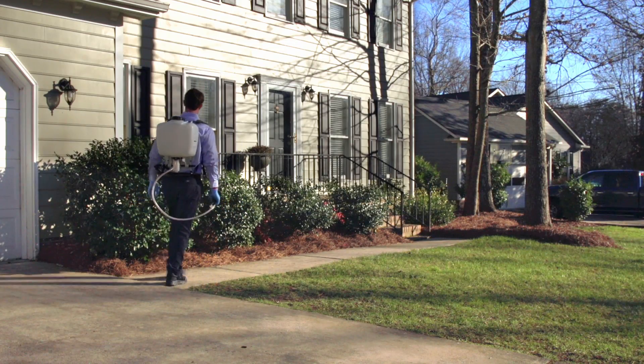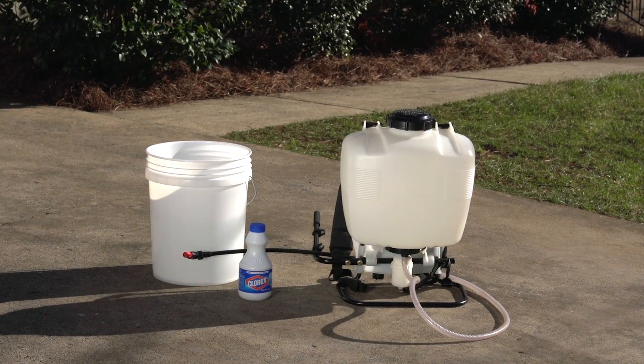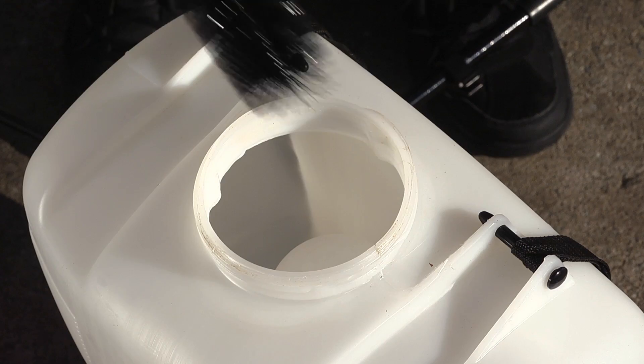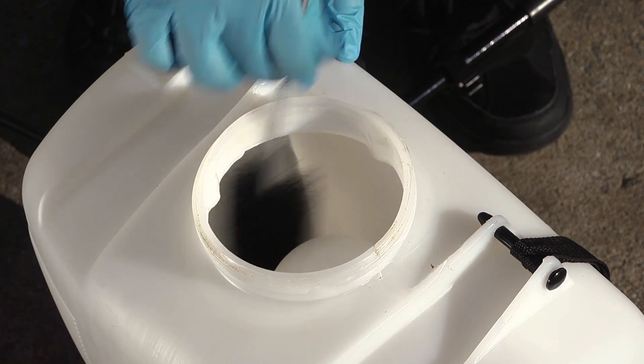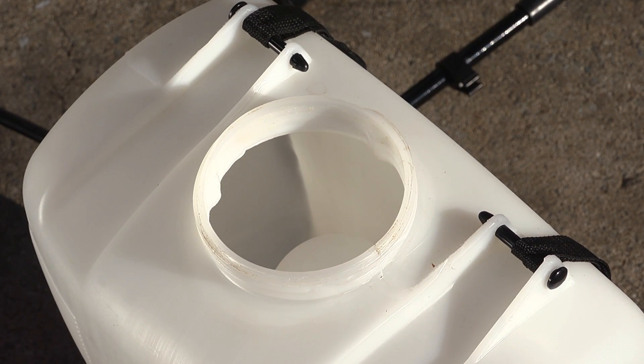You are now ready to apply. To clean your backpack sprayer, mix a cleaning concentrate such as bleach with water. Pour the cleaning solution into the tank and clean the inside with a soft bristled brush. Also check to make sure the filter is clean and has no buildup. Rinse everything thoroughly and let your backpack sprayer dry in an open state.